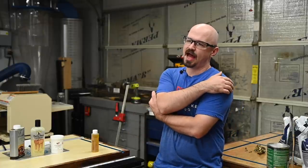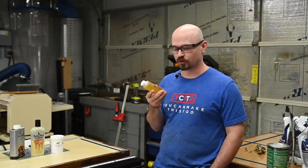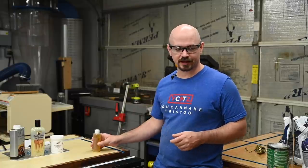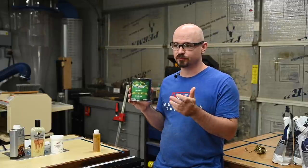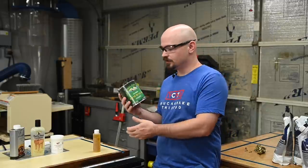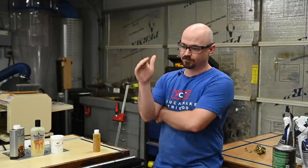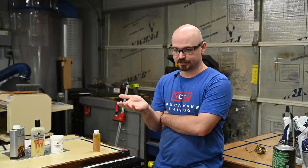Well, that categorization does serve a very useful purpose, but it's kind of counterintuitive, or not entirely the whole story, because even non-film finishes that soak into the wood sometimes do still generate a film, and a lot of the film finishes do still penetrate the wood. So to say it's either or isn't entirely true. Almost all of them have some degree of both. And there is definitely some credence to the idea that you don't want to build up a really thick, heavy finish on something that's intended to be cut on, because you can definitely create flakes.